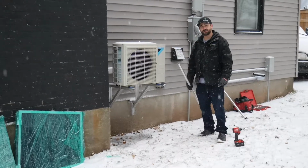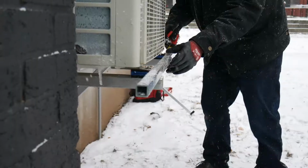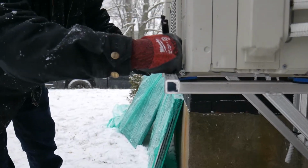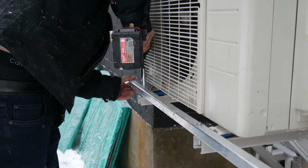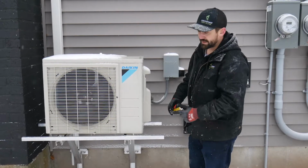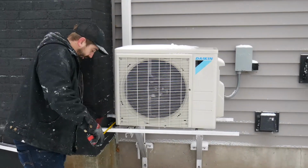So now that your machine is pushed back 1 inch, you're going to line up your bar centered with the machine, with your pre-drilled holes facing up and down, and then you can mark and drill your 3/16 hole attached with your self-driller screws. So now that you got one side of the bar, you have to make sure that these are parallel to the other side.